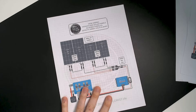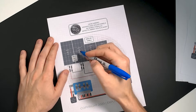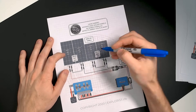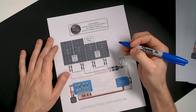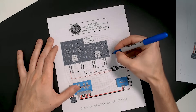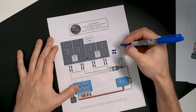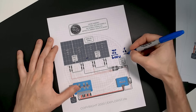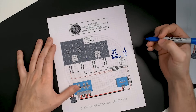Now let's say we find solar panels of different wattages but with the same or very similar voltages. This array shows mismatched 100-watt and 200-watt panels but with similar voltages. Wiring the 200-watt panels in series yields 40 volts at 10 amps; wiring the 100-watt panels in series yields 40 volts at 5 amps. Wiring those two series strings in parallel yields 40 volts at 15 amps. Using watts law, 40 × 15 = 600 watts — 100% array efficiency.